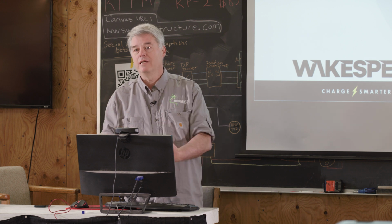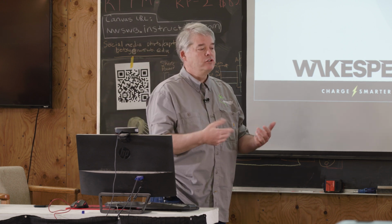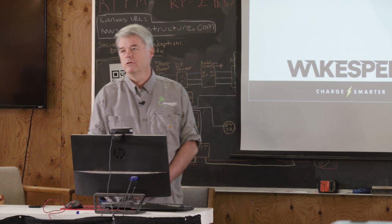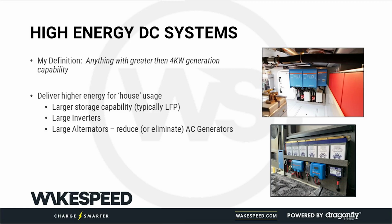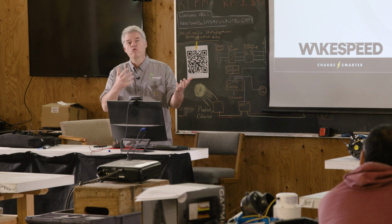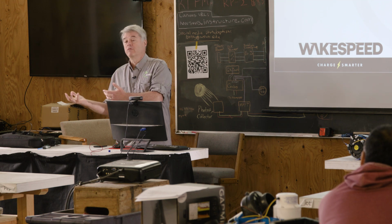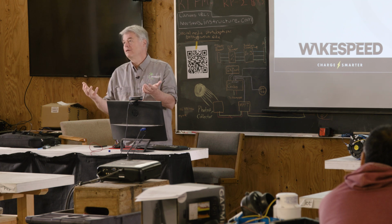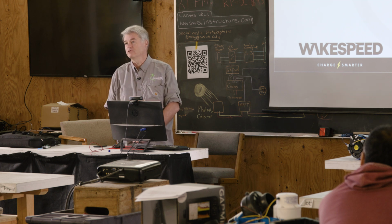My definition is a high energy DC system is when you have an alternator head that's 3 or 4 kilowatts or larger. We at Wakespeed have deployed tens of thousands of these systems. By and large, our systems go with anywhere from 5 to 8 or 9 kW alternator heads. That amount to generate power greatly increases your ability, combined with lithium-ion batteries, to recharge them very, very quickly. That's one of the key values of the high-energy DC systems.